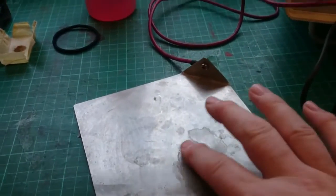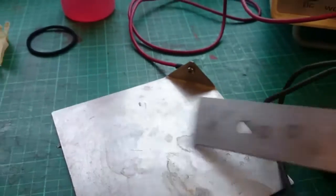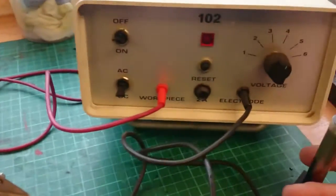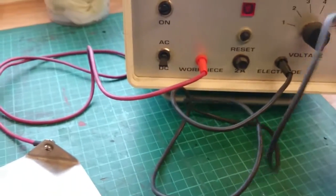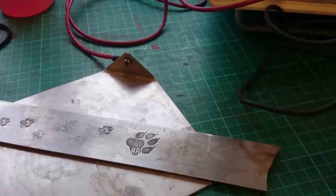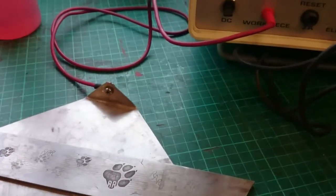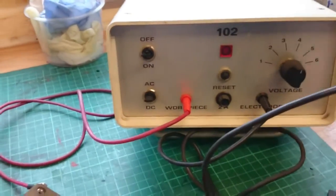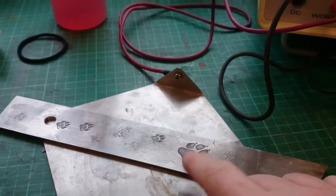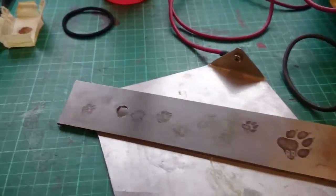This is the work piece area, which is the anode attached to the positive. So you put your work piece onto that. Direct current removes material from the blade — it eats away into the metal to leave the pattern from the stencil. Then once you've done that, you flick over to alternating current, and you dab on again. Alternating current starts laying back down some black deposits into the etch mark to leave something like the examples on here.